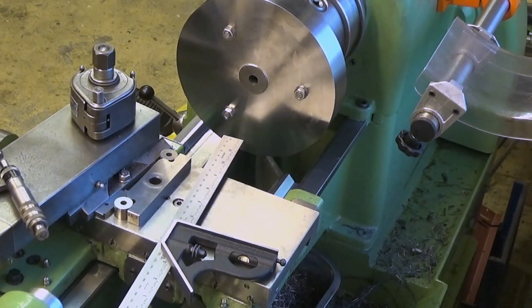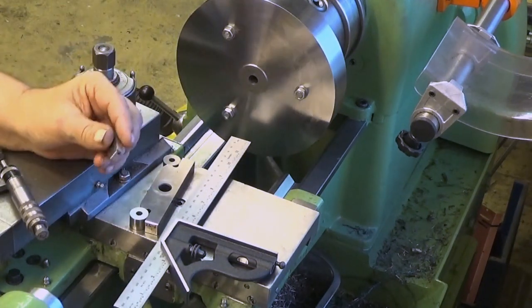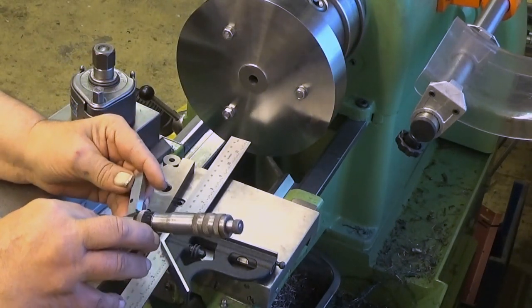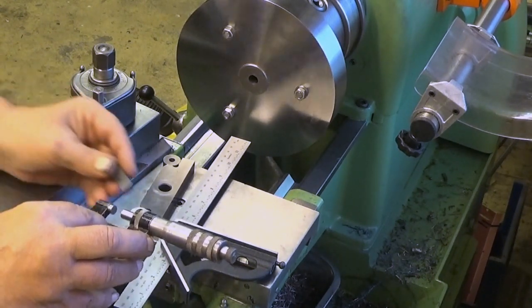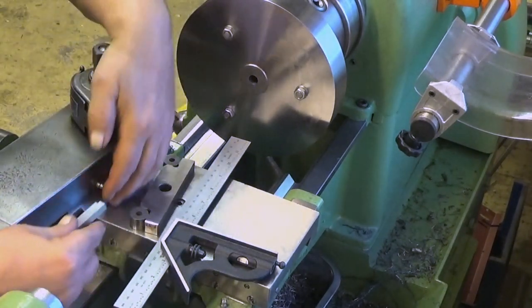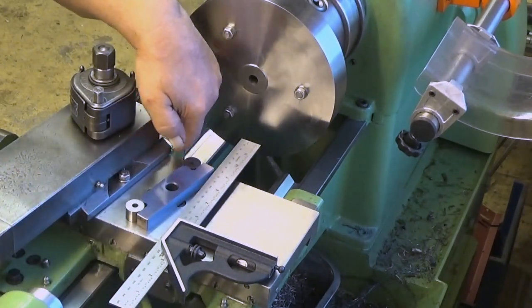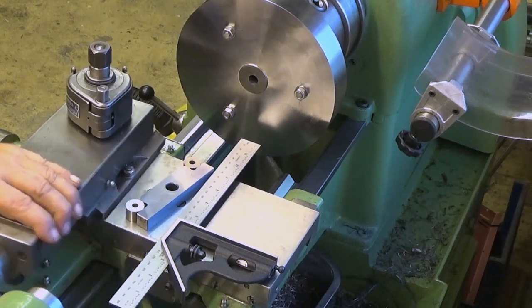The calculation in this case is really simple because we are metric. I don't have the gauge blocks, so I used my micrometer, adjustable parallel, and now it's exactly 12.40 millimeters, the thickness of this one. And now when I place it under here, everything is cleaned, because I assume that this surface runs parallel with the slide. If it is not so, this won't work at all.